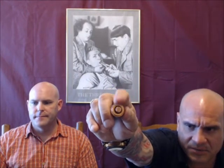Corrosion, or actually it's been varnished. It's not actual corrosion, that you typically think of when you see an electronic device where the battery is all corroded. That's completely different. So what happens is your connector, where your contact comes in, winds up getting a layer of junk on it, basically. I talked about this in an earlier video where I was disgusted with another piece of equipment, but you can go back and watch that video. What happens is your contact gets mucked up, and so you actually have to clean it off.